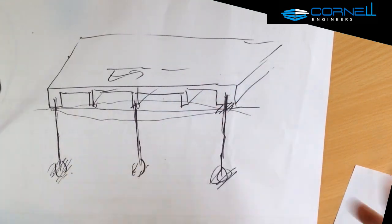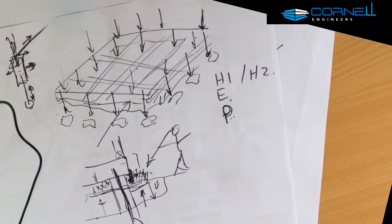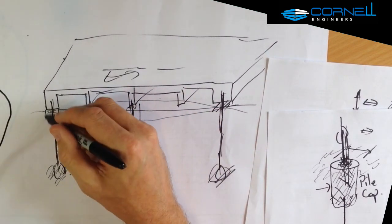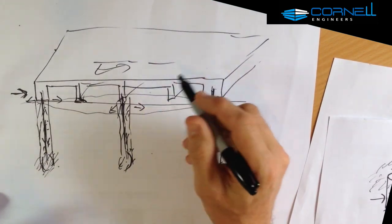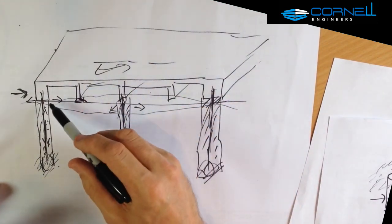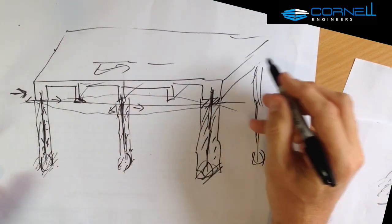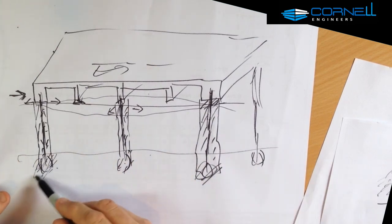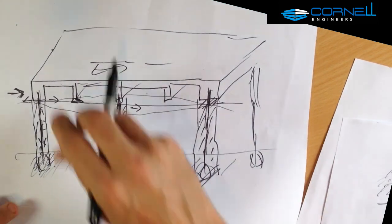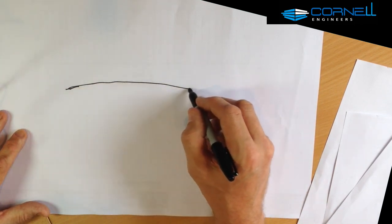Unfortunately, without pile caps we don't have any lateral support, because we've got a layer of soft soil surrounding the posts. We also end up with a house that doesn't really have a lot of lateral support. The recommendation for waffle slabs with screw piers — if you're going to have them around the outside at whatever centers the engineer specifies — is that you should really be looking for screw piers at intermediate points in the middle of the slab, so everything is founded at that same firm level at depth where the screw piers are embedded.